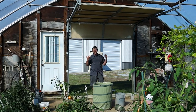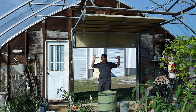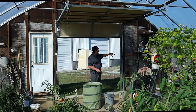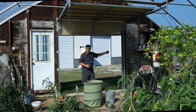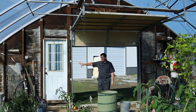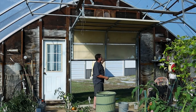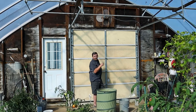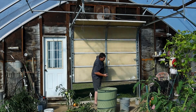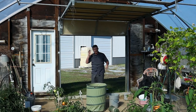Having a solid wall on the north end of our high tunnel has allowed us to do a few things. As you can see, I had some plywood that I just sheeted the end of this thing with. It gave me a good solid place to mount electric that I ran in here, and also water. On the outside of this wall I also have a hose reel, which is very handy. It makes this end of the high tunnel more structurally solid. It allowed me to put an entry door in this, and it made it real easy to put a roll-down garage door in this end. It also allowed me to put an exhaust fan in here, which helps pull air out, and I've got that set on a thermostatic switch. I really feel like this solid wall has allowed us to do some things that a plastic wall wouldn't.